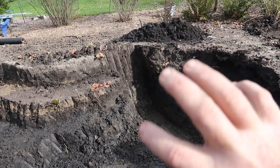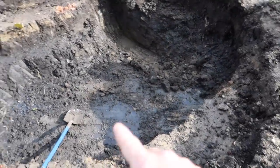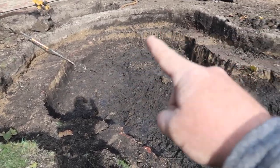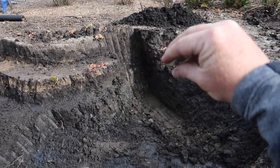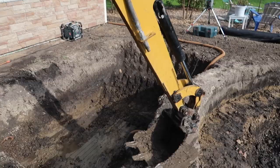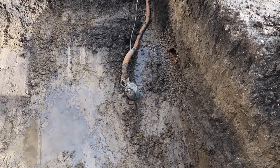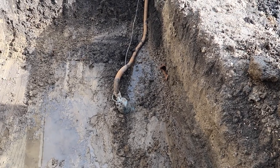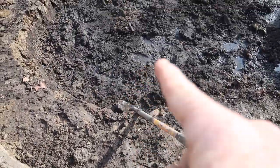I want all of that surface debris to get pulled over into this area so the skimmer box will grab it. If I put the snorkel anywhere else, the water moving from that area could get pulled away and not make it into the skimmer box. The other challenge we have on this site is an awful lot of groundwater. Chris has been using the mini machine here, and we found a drain tile over here — nothing's coming through the drain tile itself but definitely coming through the vein of gravel around it. This pump's been running for three hours straight, and you can see some areas pooling up in here and there.